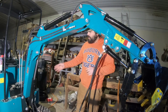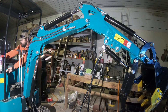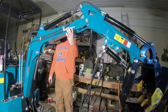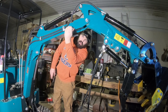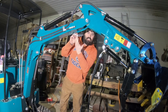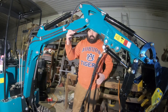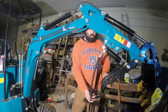Now we have to determine on the machine what the foot pedal controls — whether it gives pressure to this line pushing forward or this line pushing forward. When I push forward, it's sending pressure into this hose. When I pull back, it's sending pressure into this hose. Now we've determined that pushing forward sends pressure into this hose, and if we want the forward to close the thumb, then we need it to be on this hose.